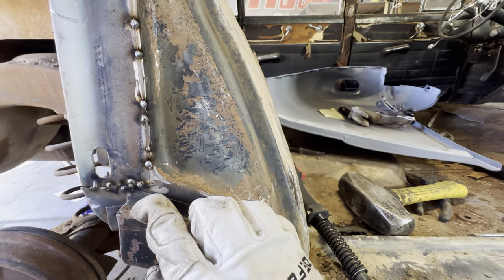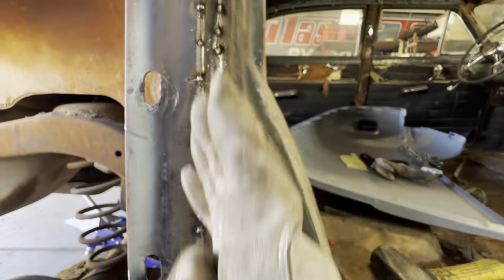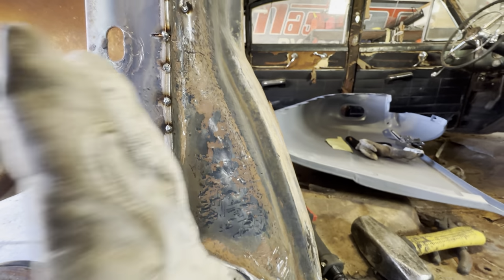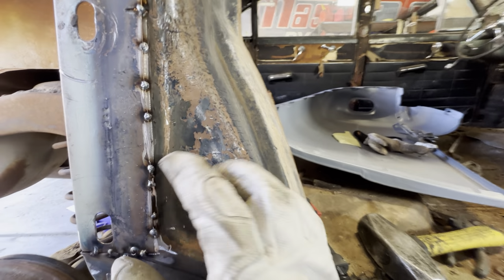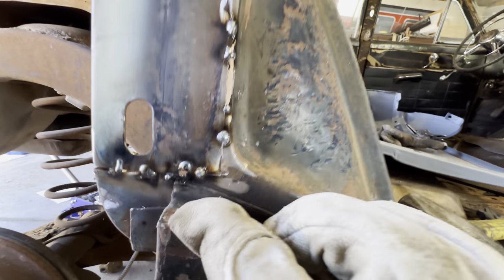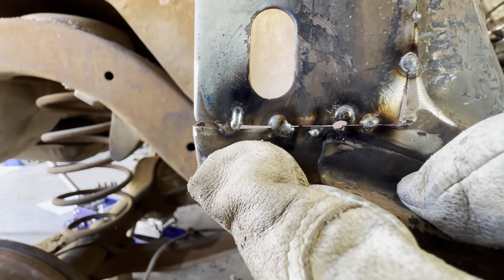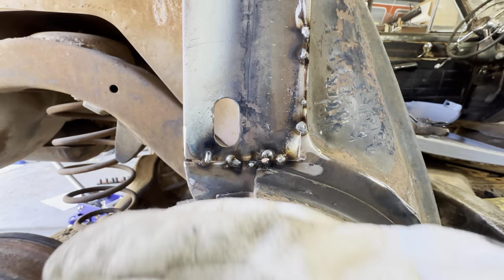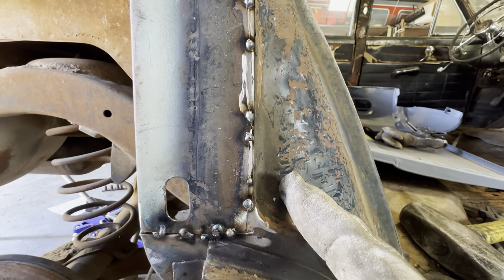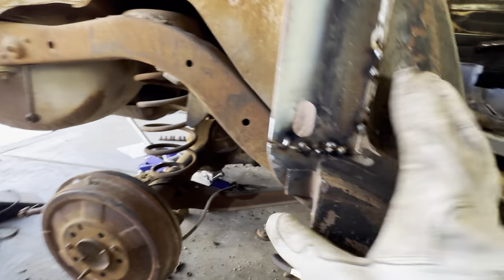got it to where this corner lined up perfect, like I could just pull it in and out without it touching, because remember, when you cut, the width of the blade and any wiggle is going to be removed, so you really want a blade width gap between these pieces. Otherwise you're making it smaller, because you're cutting out a 16th of an inch here and a 16th there, and over a mile it adds up to a couple feet.